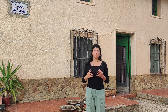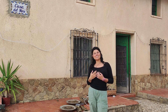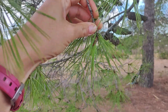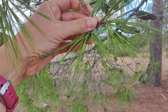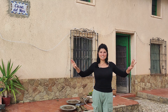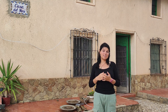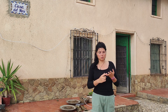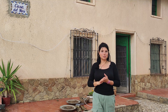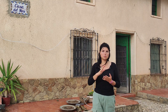What blocks the signal? Concrete walls block the signal, and walls made of rocks block the signal too. What was unknown to me is that trees block the signal quite well, and pine trees block it tremendously — because every single needle works like an antenna. The entire pine tree acts like multiple antennas that scatter signal all around. You don't want your receiving end next to pine trees. Water and humidity also block the signal, so avoid placing it next to plants, trees, other buildings, or any humid corner of your garden. You want it in a dry, open place, ideally on a hill.